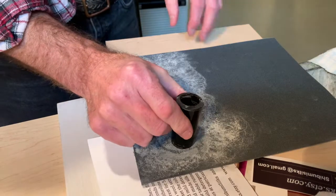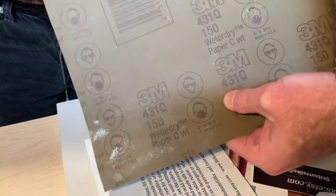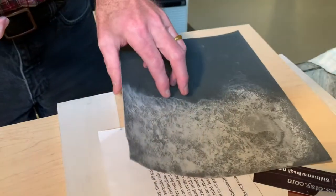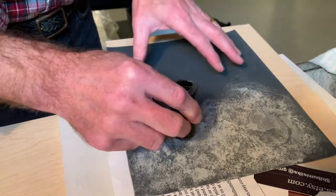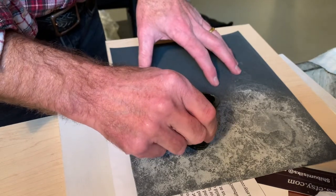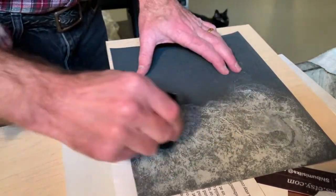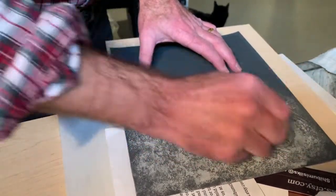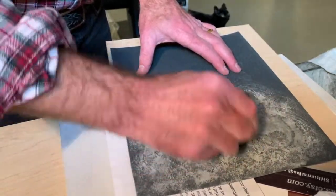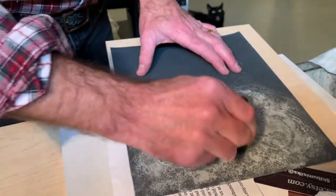Here we will start our sanding process on the slide. We are using 3M 150 wet/dry paper. You can start out at the 150 level and then keep working your way down — if you want it ultra fine, go all the way into the late 1000s or even lighter grit than that to really put a polish on it. What I do is just circle around and around on both sides, going through multiple passes of the different grades of paper until we get it into a nice polished condition.